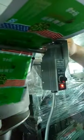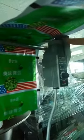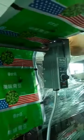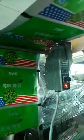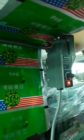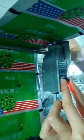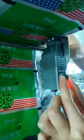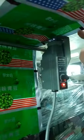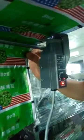Test several times. If it is stable, it's okay. You can see the label light spot — when pointing on the film white part, it should stay on all the time. If it keeps flickering, you still need to turn right about one millimeter to make sure that when the white light spot points on the film white part, it's not flickering.